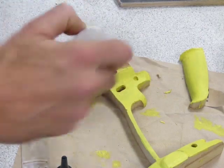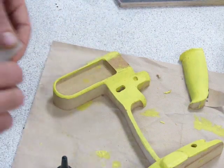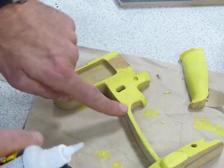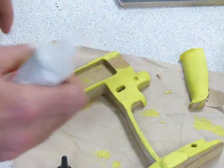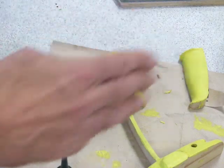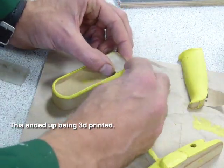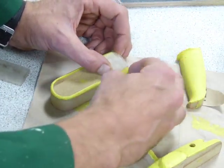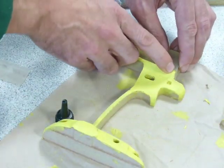So when you're near complete, you can start adding the detail parts, for example these plastic parts that I've cut out. The idea is we'll put them all together, and then any last imperfections like that and this little bit of damage there, I can just use car body filler. Blending any bits together, for example the top bit here will need a little bit of filler between there and there. There's a step either side if you look on the drill, but then this bit here blends into that radius there. So I'm going to just use a tiny bit of filler on that side.